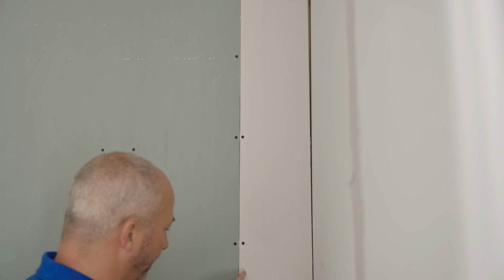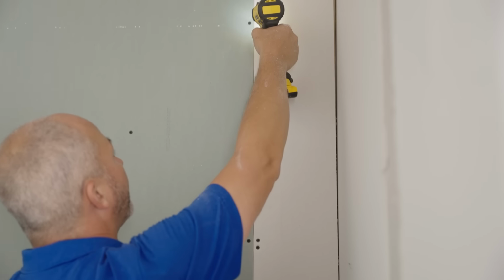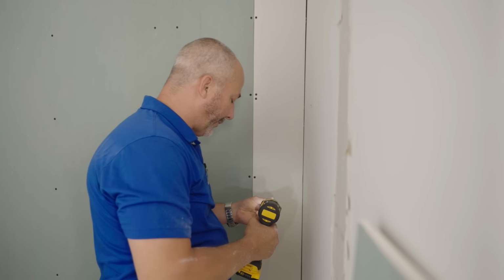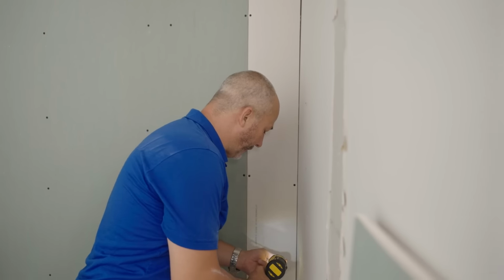If it was a butt end, a lot of times I'll see people do this. They put 2 screws. It holds the drywall together much better. So if you're running into trouble, try using 2 screws. It's still the gold standard in commercial construction, and there's a reason for that. If you ever try to take a wall apart that has 2 screws in every location, it is work. It's easier to take out all the screws.